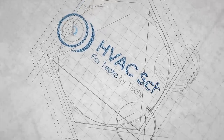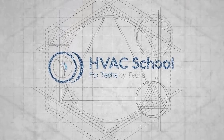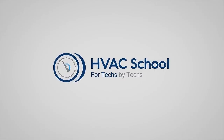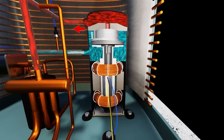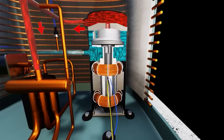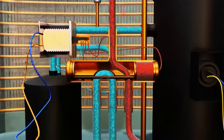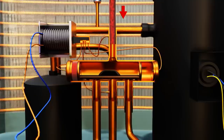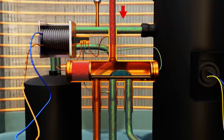Let's talk about discharge line temperature — that is the line that goes between the compressor and the condenser coil. If you've got a heat pump, that can be kind of tricky to find, but it's the part that goes generally into the top of the reversing valve. It's the smaller single line on one side by itself, and that feeds into your condenser coil.